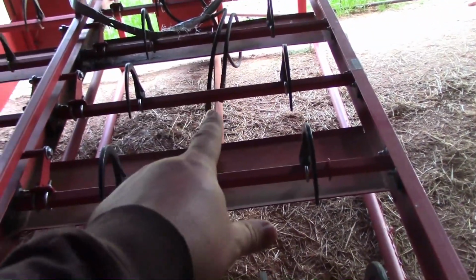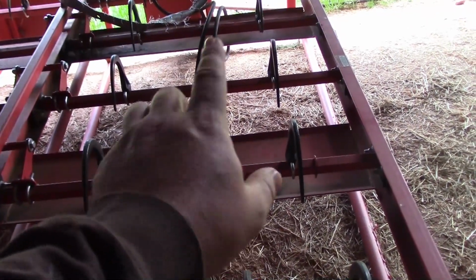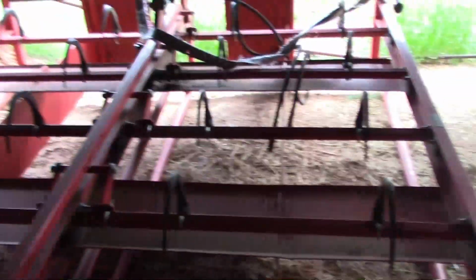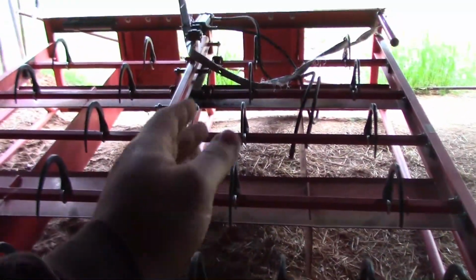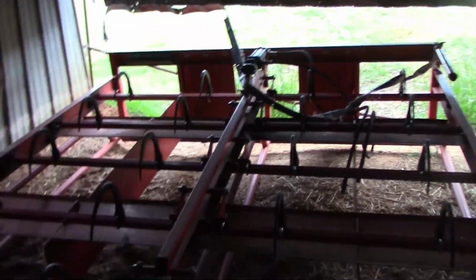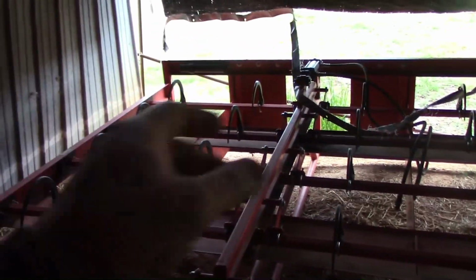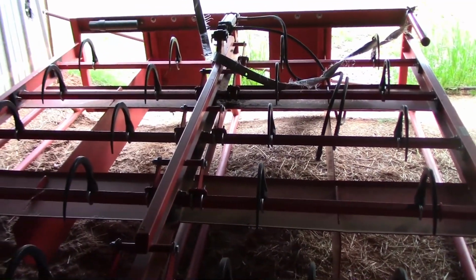Now if you have those hooks that way, you can't pick these bales up with those pieces on, because you'll drop them everywhere. They won't stay in there, they'll fall out. Now if you go by another grapple like this, you can unload with this one. You can accumulate, grab them, stick them on the trailer, take this end bar, push them over, make your stacks tight as you go, and load and everything with this. And you don't have to run around the field accumulating first. Now they don't tell you that.